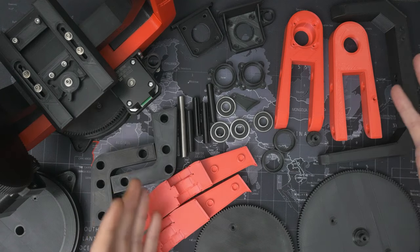These are actually the next bit we're going to assemble - this is part of the pan axis assembly. These do go a specific way around - I'll show you how to figure that out. You'll notice if we put them one way the edge doesn't line up: this sits proud of this. But if we swap them over, that edge is then perfectly level with that edge and that edge is perfectly level with that edge, so you know you've got them the right way around.